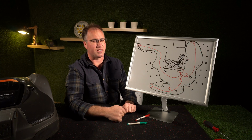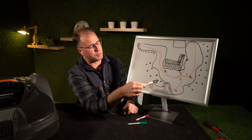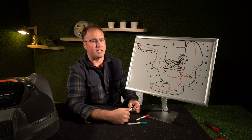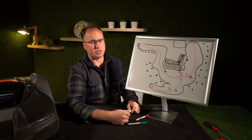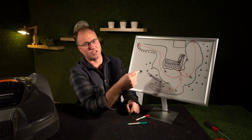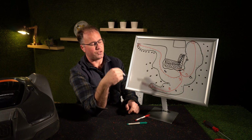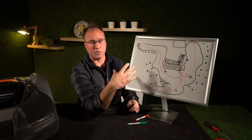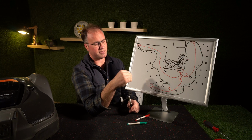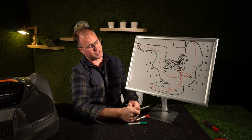So an advanced mower like this in lawn, it's going to have GPS assisted navigation, but GPS is only accurate to 2 to 3 meters. So that's why guide wires are critical, because then it eliminates the need of that accuracy for GPS. There are other models like the 550 EPOS and future models coming up that can go without wire, but that's a whole other topic. We're just talking about when you do have a wired system and you are using guide wires.